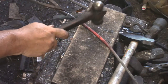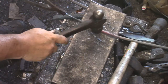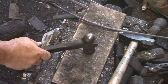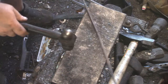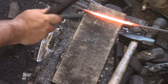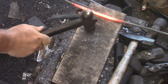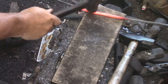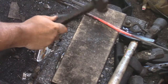I've been going pretty light with my taps on this, especially under a visible heat, because for some reason this steel is really soft and it doesn't take much at all to put a divot in it. Trying to round this up after tapering, the least amount of divots you can get the better. Just a standard 4 to 8 to 16, and then planish.